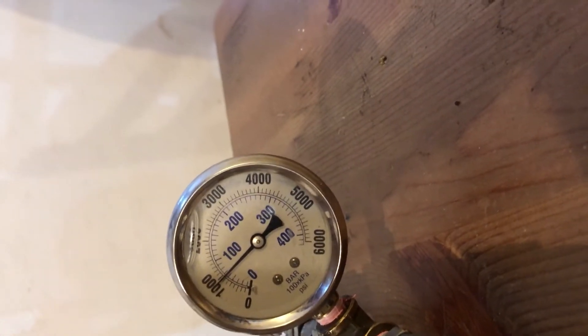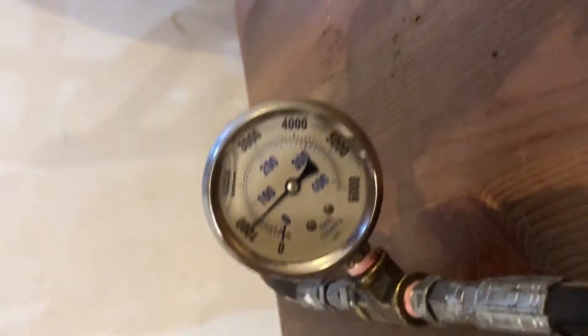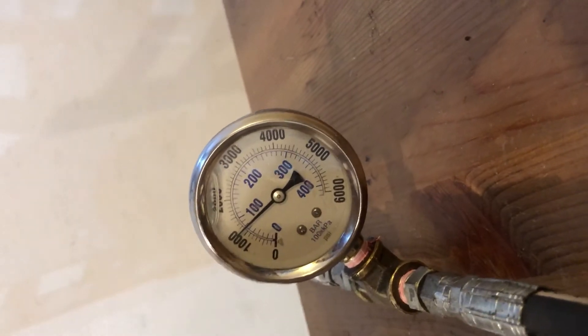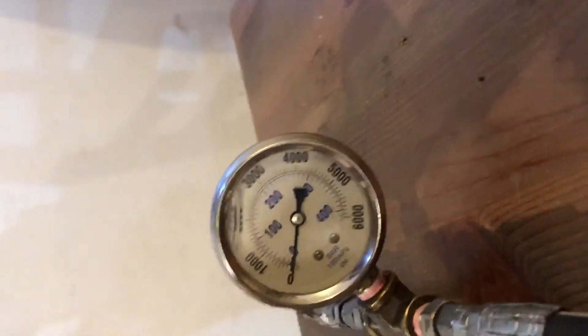This is where that thickness of acrylic window is rated to fail — I'm not saying it will fail at exactly that amount, but that's what the chart says, that's the failure point. Nothing yet. 1,200 pounds. There it went — 1,300 pounds.